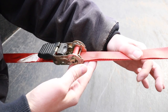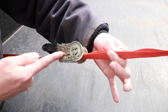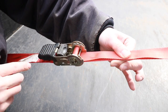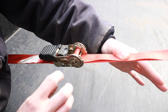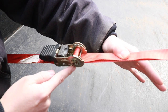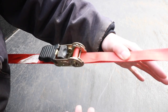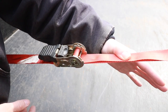The way that tension is held on the ratchet strap is twofold. First, it's the progress-capturing tab — the locking tab — which prevents the spool from back-spooling. But also, what prevents the webbing from backing out of the spool is the friction of it being wrapped over itself. Right now, because the webbing isn't wrapped around the spool multiple times, there's not very much friction. So as you go down the road and hit some bumps, it's almost guaranteed this will loosen up.